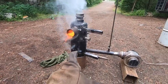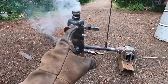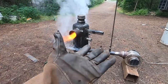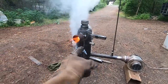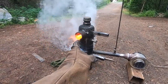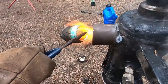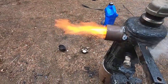So what I actually ended up doing, this was an interesting sort of counterintuitive thing that I really wouldn't have guessed, but if there's too much airflow, what you end up with is just a cyclone running around. Also ignore those leaks. The cyclone just stays circular because it's moving so fast that the heat doesn't have time to lift the flame up and out that outlet. And so what happens is you burn all the fuel before it reaches the exit. That was certainly a success.